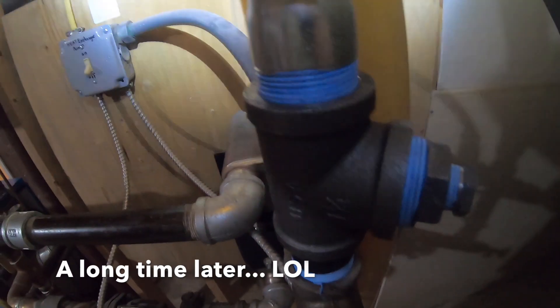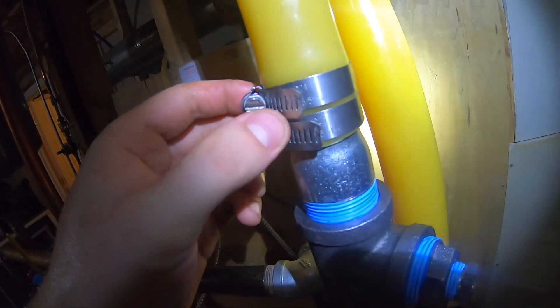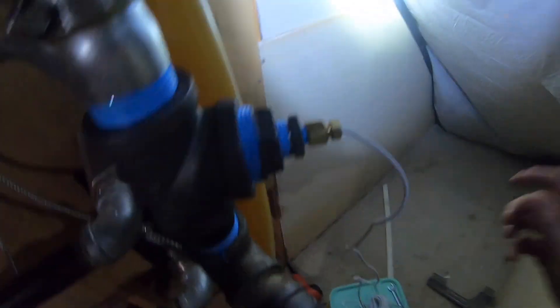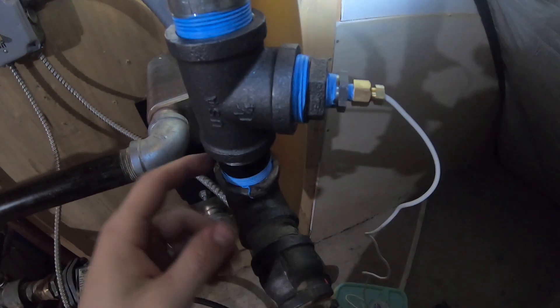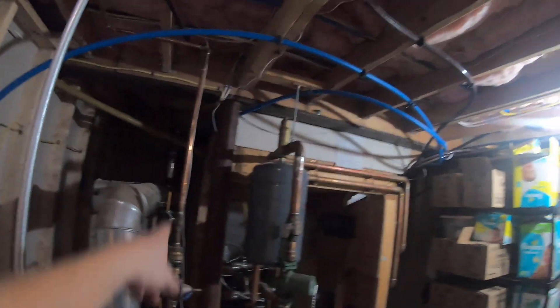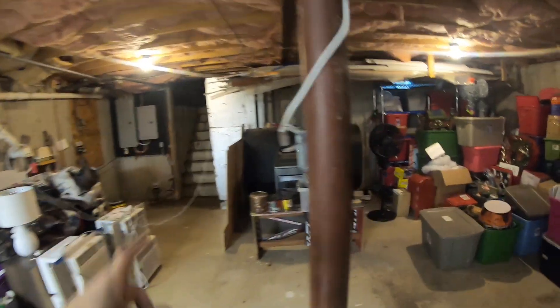After a lot of heat with the hair dryer we got the PEX heated up, slid over, two band clamps tightened to all hell. We put the sensor in — pretty snug. This is taking me days to do. We're going to run the sensor wire up to the bedroom. I ran the sensor wire along the wall, loosely for now, behind the oil tank, and up through a little hole I drilled in the floor using an alligator clip to pull it through.